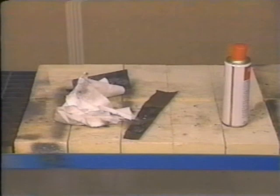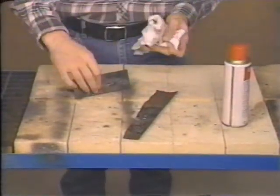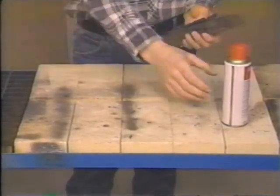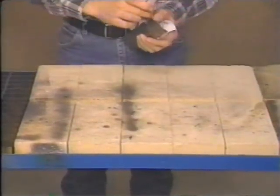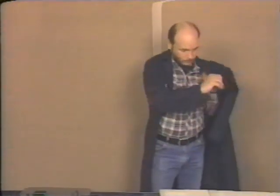To begin welding, you must first prepare the area in which you will be using the welder. Remove any combustible material like paper, rags, paints, or fuel. To avoid electric shock, don't operate the welder in wet areas. Be sure to cover all exposed skin when welding.